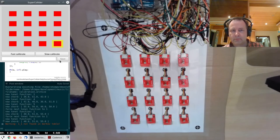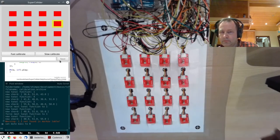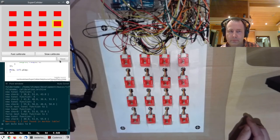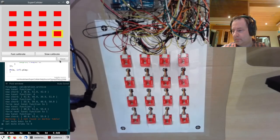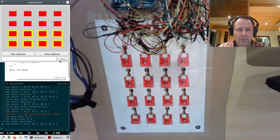And this forms the second layer in the system. The raw sensor values, as measured by the Arduino and conditioned by the calibration, are now being observed by a simple pattern recognizer. The musician can specify which patterns should be recognized. A pattern, in the end, is just a collection of sensors. Every time such a pattern is recognized, a signal is given in the form of calling a callback function.